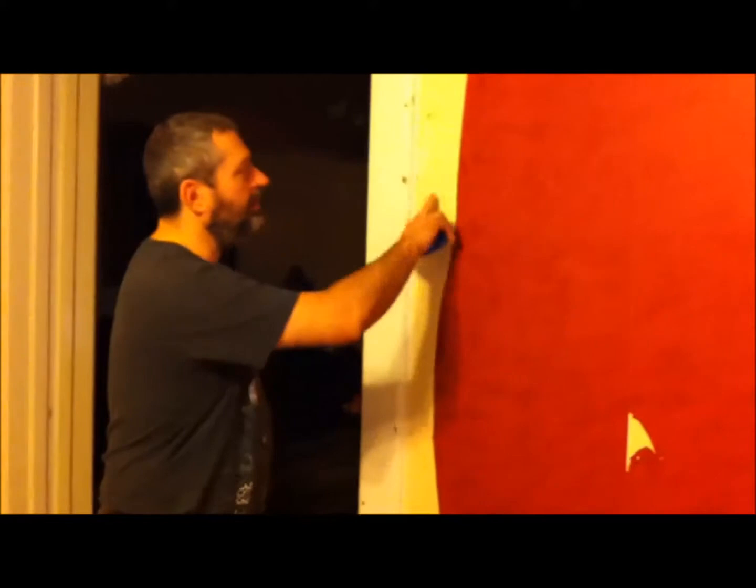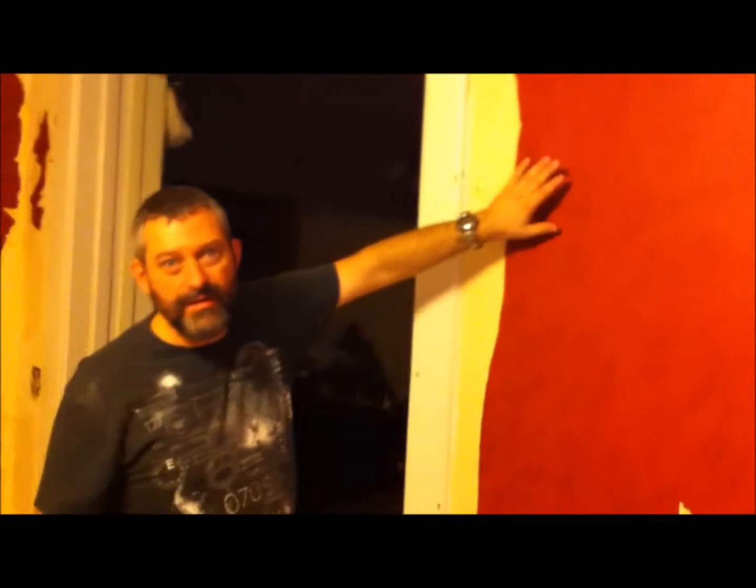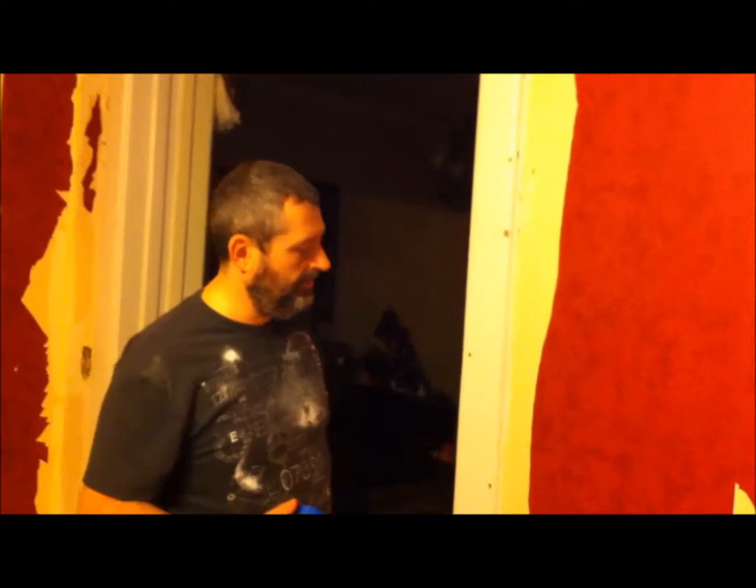Okay, scoring the walls. We don't care about the paper - we tried to pull this off and some of it came off in little pieces, so I'm going to pull all that. This part I'm not going to score, but anything red I'm going to score because it's vinyl. That solution won't go through the vinyl - it just sits on top of it - so you've got to poke holes in it to get the solution into the paper behind it.